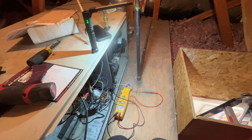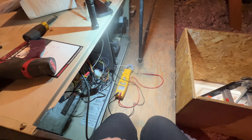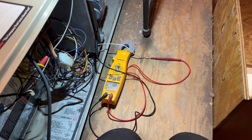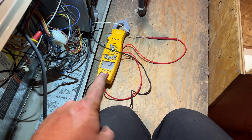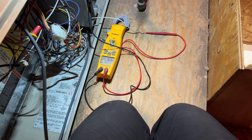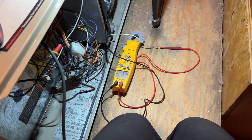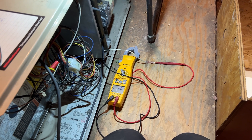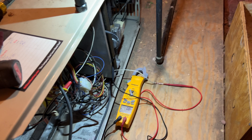We'll let it run for a bit and see what's going on. That's why it's important to clean the flame sensor — it's a pain in the butt to do. So she ran for a little bit but then she went out, and my flame sense was consistent, holding at like 5 microamps. It just cut out and then restarted. So there's something else going on. Just cut out again, so it's not our flame sensor. Well, that sucks — we took that whole burner assembly apart for nothing.